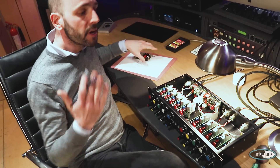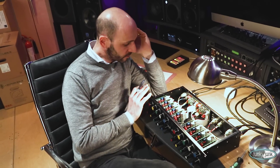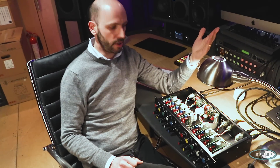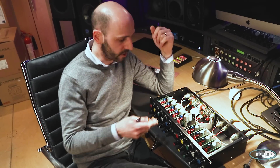Other than that, this is an amazing unit. I'm really happy they're manufacturing them again — it's just a no-brainer, I absolutely love it. In terms of how I normally use it, it's normally low-end and top-end across the mix: dial in a boost at 60 or 80 Hz and a bit up at 10, 12, 15, or 16K. During tracking it's an amazing tool for finding the frequency, cutting out what you don't need — dive in with a high Q to narrow down on a resonance and cut maybe 3 to 6 dB maximum. In and out with the bypass and you know you've nailed the frequency. Amazing tool, worth giving it a shot — always.